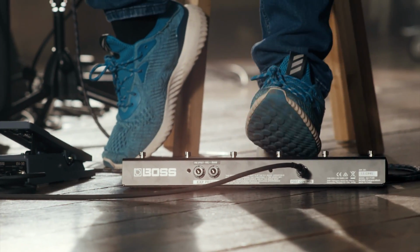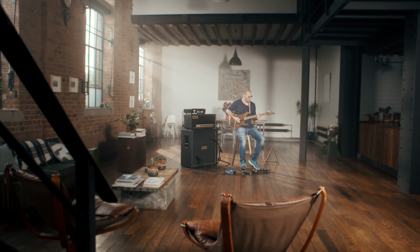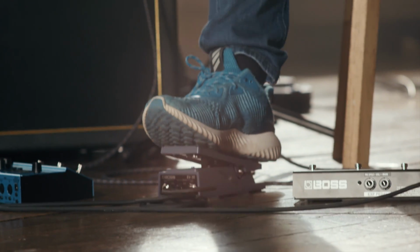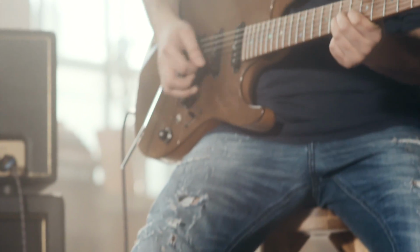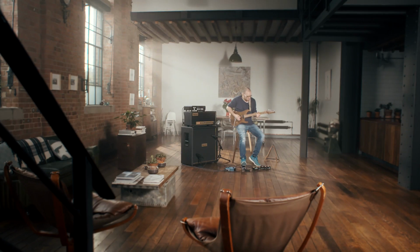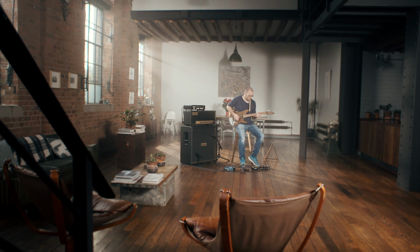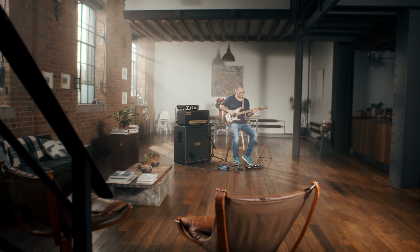The WAZA Tube Amp Expander has a premium quality DSP section on board for adding effects, with 32-bit analog to digital conversion, 32-bit floating point processing, and a 96 kHz sampling rate. It has compression, tap tempo stereo delay, reverb, and EQs which can be independently controlled via a foot switch, along with the effects loop, solo EQ control, amp channel control, and the cab and mic sim settings.